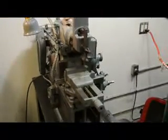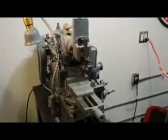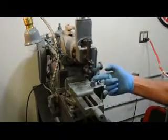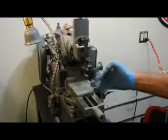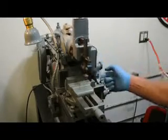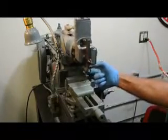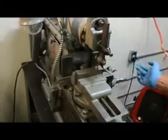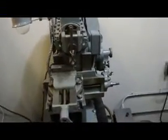Now see that again because that was a neat interesting point. You have to have enough clearance on the front when it goes forward so that the clapper can come up and clear the work and go back. And on the back you have to have about three-eighths of an inch so that it goes back far enough to advance the feed. All that's going to be shown in the manual as well.